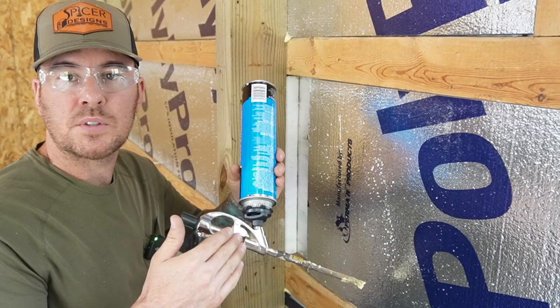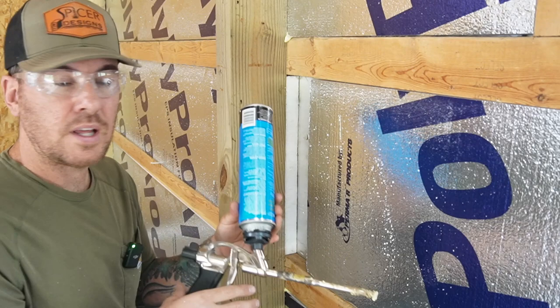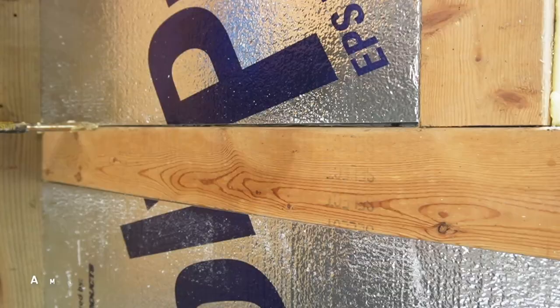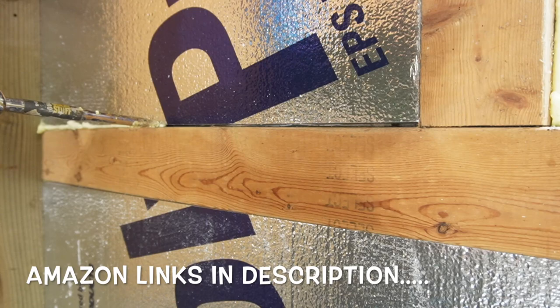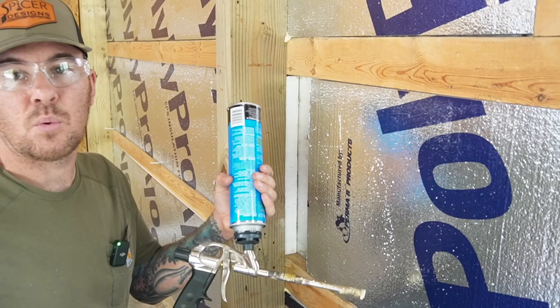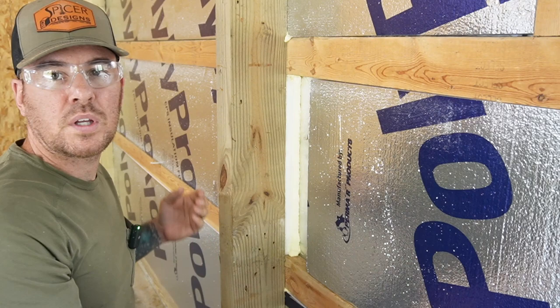You may have seen this on Hometown Acres — Adam used this when he was doing his barn build out. I've had this spray foam gun for probably five or six years and I've never had an issue with it, never got it clogged up, never ran a cleaner through it. I just always make sure I have a cartridge hooked up to it. These cartridges you can get from Home Depot or Menards — they're kind of expensive, anywhere between 15 to 20 bucks, but they last forever. You can plug this thing in, use it for a couple of passes, don't touch it for six months, come back and it still works. Just put a little bead right in between that seam and then slide the piece over and smoosh it in so you get a nice tight seal.